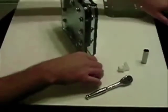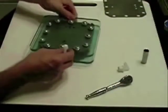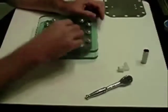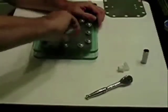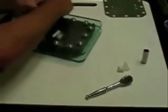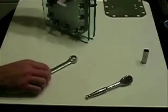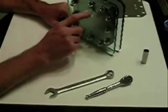I've already taken the liberty of putting Teflon tape on these fittings, as I said earlier. These fittings are, I think, half inch — anyway, that's what that was and I tapped it out, so they should go on with no problem. They line up very well. Once you put the Teflon tape on there, there's nothing like a trusty Craftsman wrench. This end will be at the top where the gas will come out, and this is the end that will go out to your bubbler.